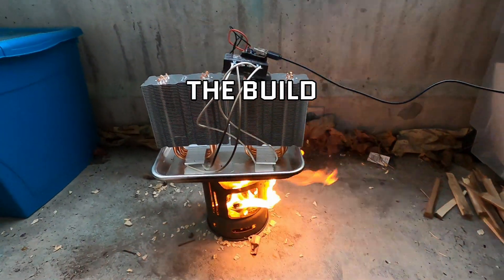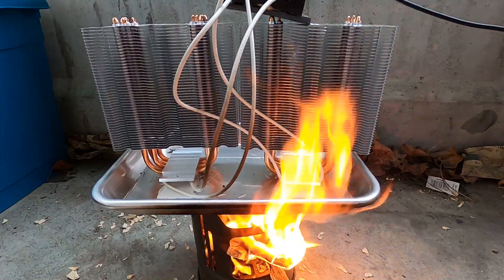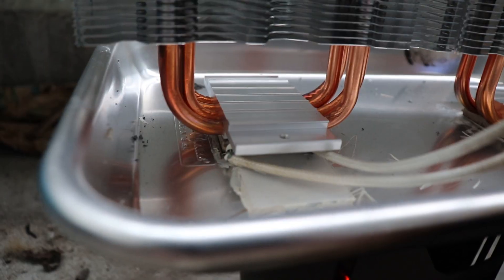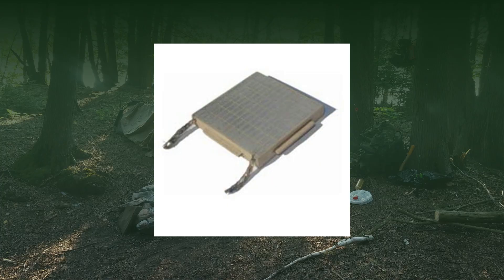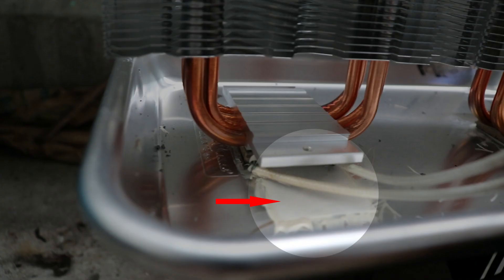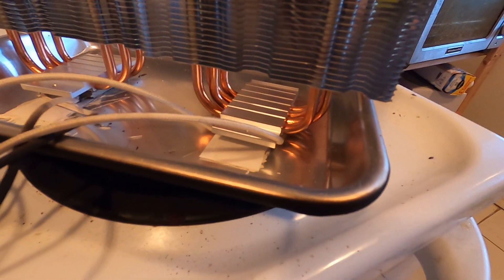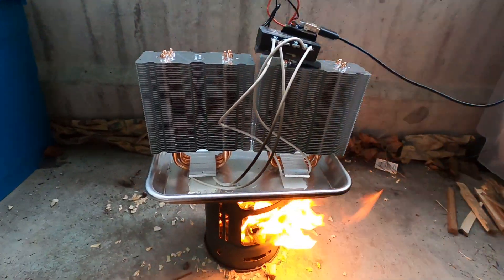The build is pretty straightforward — I'll have a complete parts list in the description. Heads up that the Amazon links are affiliates. I used a small aluminum tray as my hot side platform. I chose it this way so that the heatsinks are kept out of the direct convective updraft from the heat below. I connected the wires to the terminals on the chips simply by tightly twisting the wires to the chip's positive and negative terminals. With these specific TEG chips, unlike the cheap ones I was using, they are not electrically insulated — the surfaces are the thermocouples of the chip. You get these little ceramic wafers to keep it separated from the metal of the tray and the heatsinks. For the heatsinks I'm just using some cheap tower style Deep Cool four-pipe heatsinks — nothing fancy. They're really not meant for convective cooling but I find they work fine even in dead air inside. Outdoors where there's usually always a breeze they become much more efficient, especially in colder weather.